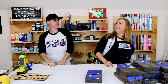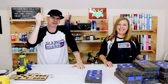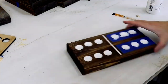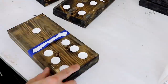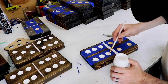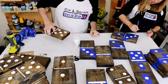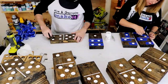Step seven — now we're gonna paint all the little dimples with chalk paint white. The great thing about taping and routing first is that it's already masked off for painting. As long as the painter's tape is pressed down well, you have a ready-made template. Just paint the way in, and remember to peel it up before it dries so you don't pull the paint up with it — you can peel it while it's still wet since they're dimples.